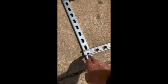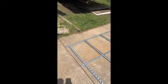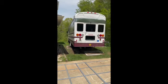What's going on here is all these cross members that run this way represent the ribs on the bus — the hat channel that we welded for the roof raise. What's going to happen is I'm going to drill through that hat channel up on the roof, send a piece of all-thread up through it, and the all-thread is going to come up through these cross members that go across the length of the bus.